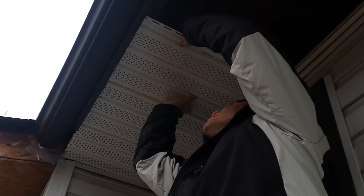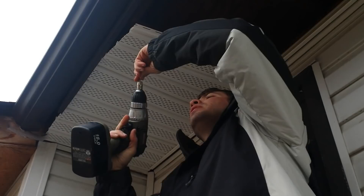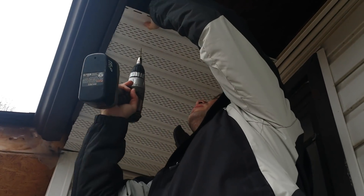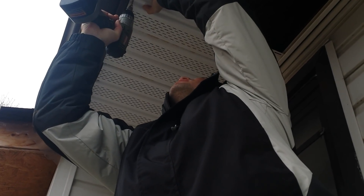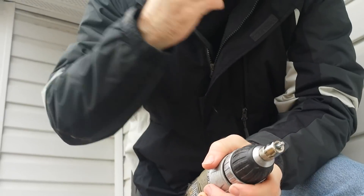Pull that up, get this going. It'll kind of hold itself after you have the first one in. This is also why I like using Torx bits - you can sit the screw on there and it will hold itself as long as you have a good spot to set it. Make sure you don't go in too deep. I turned my drill down to 14 so when it gets tight it clicks and stops. If you put it on drill mode it's going to eat through and go through the plastic.